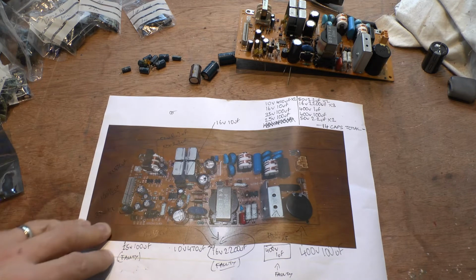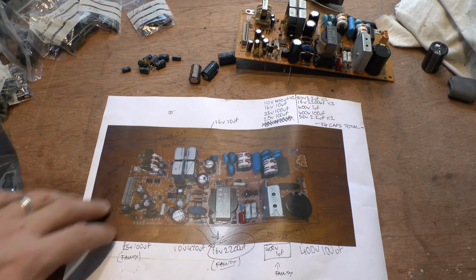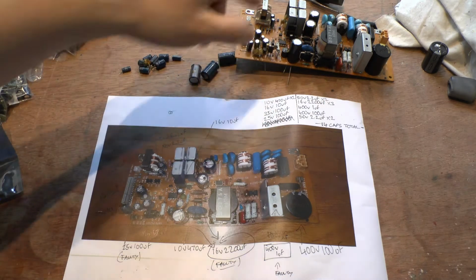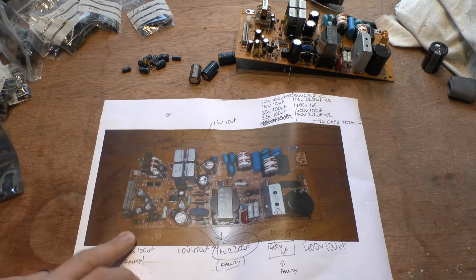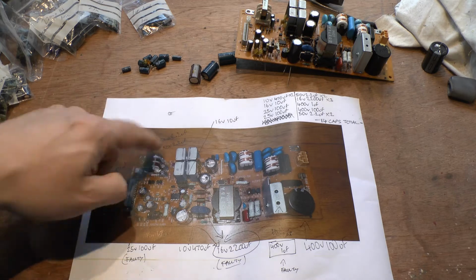Whereas this is what's known as a soft power on, a bit like an ATX type power supply, where the button on the front is only, you know, 12 volts or whatever. I don't know exactly what it is voltage wise, but let's say it's 12 volts, so it's powering on the thing soft, telling this power supply to turn on. Whereas the old style one on the AT power supplies, or the style on the 925, is a hard power on. So basically you have the 220 volt switch in and around this location here. There's a big button on the front of the 925, a big bar goes along and turns the switch on and off.